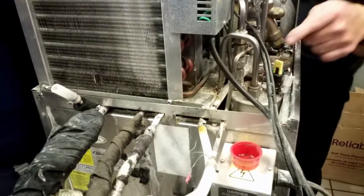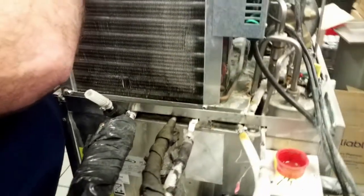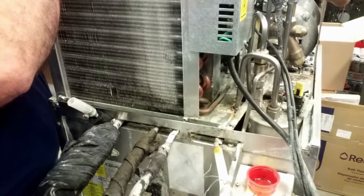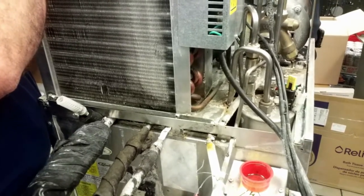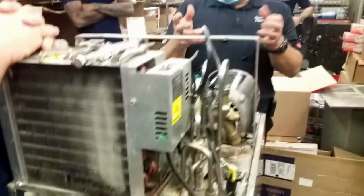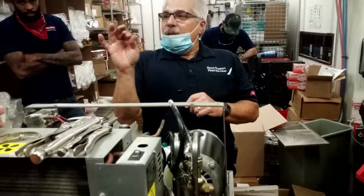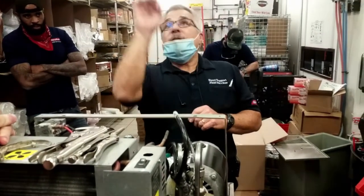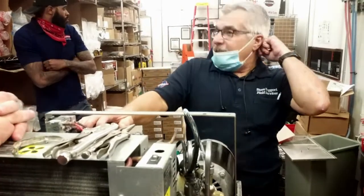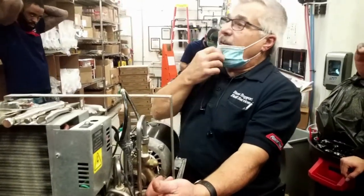One of these check valves is there, so you can take them apart. You can take those check valves apart, and normally the O-ring is just out of place. You can take it all apart and put it back. Be careful, because there are little springs in there. It's a little silver ball, like a ball bearing, and it'll go fine. That's the only way you would know, or backflow from the CO2 is coming through that valve and feeding back into the water line.